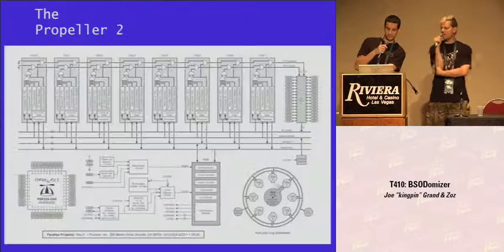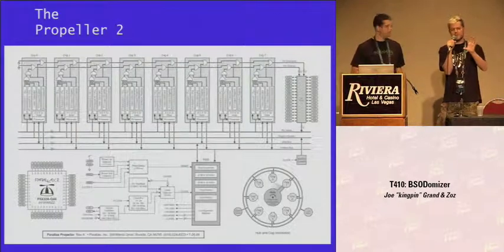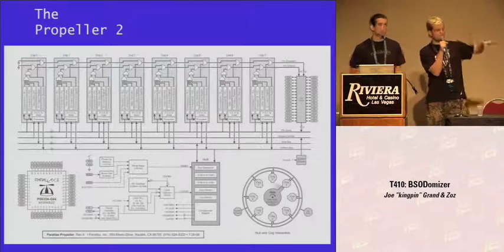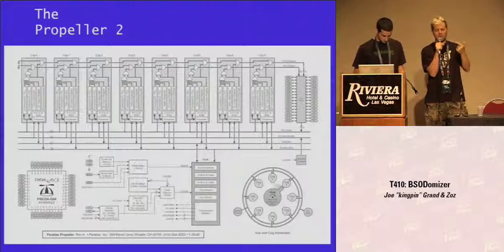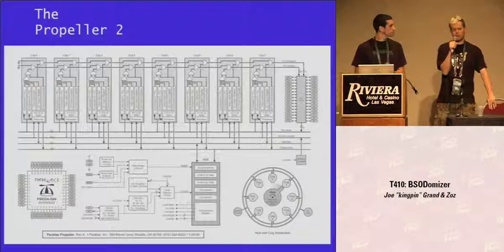It's a really interesting hardware design. As far as a small microcontroller goes, it's basically designed for multi-threaded operations. It has a whole bunch of little cogs inside that are like independent processes, but they have shared memory and they can communicate with each other. You can put areas of code to an individual cog, and the scheduler runs around and gives time to each cog in turn. Even if a cog's not active, it gives the time so you can do time prediction, meaning you can really write close to multi-threaded code on this little micro.